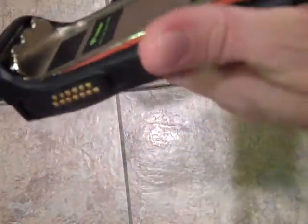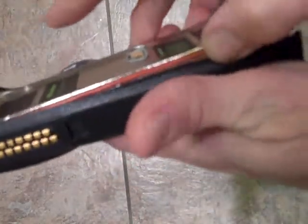watch that O-ring. So many mistakes are made because people don't guide that O-ring in when they close it. Keep your fingers on it and watch to make sure that it's clearing, because when it doesn't clear, that's when you've got problems, and that's when you can snap that O-ring.